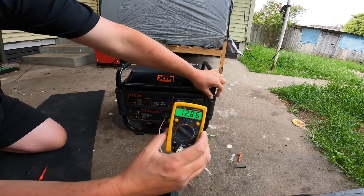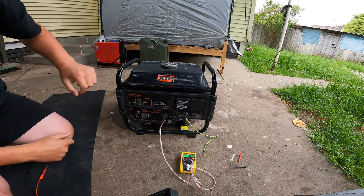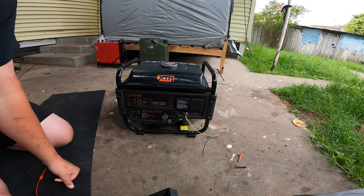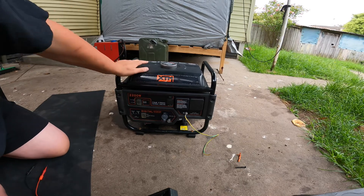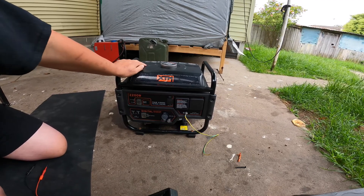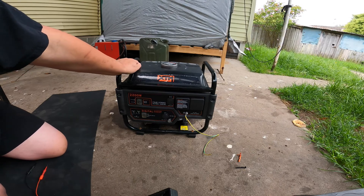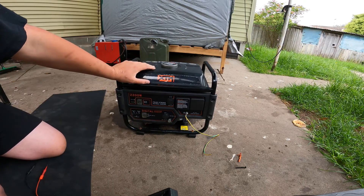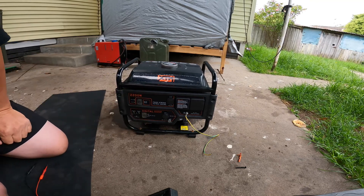We're getting about 12 volts out of it but I think it's working hard. So we've got 12 volts happening on it. The inverter module is dead — it's chock-a-block full of potting compound. The only real way to make this work would be to rip that inverter module out and plug it into another mains inverter, but I don't really like that idea. I'm going to give the guy the bad news that this is probably uneconomical to repair. Quick diagnosis — not a hugely long video, but I dare say this is a common thing with these. I see a lot of them up on marketplace and this is probably why. Anyway, see you in the next one.